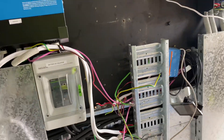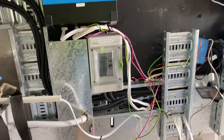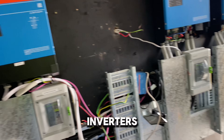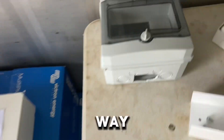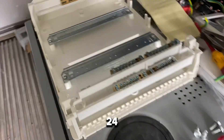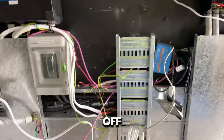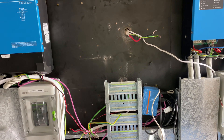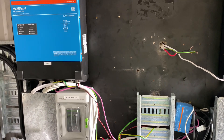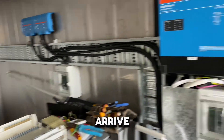As you can see, I've done a lot of the cable tray work. It looks really messy at the moment, but I've run a lot of the DC cables to the inverters and back to the Victron Links. I've pulled off the old switchboard because it's way too small. I'm putting in a 24-pole switchboard because we're three-phase now and need a lot more room. Once the remaining two batteries arrive we'll commission the system.